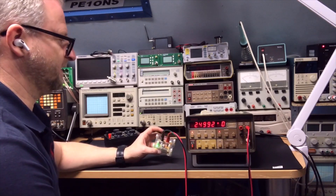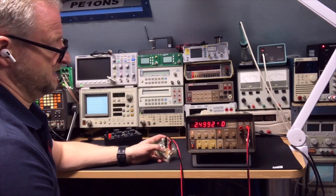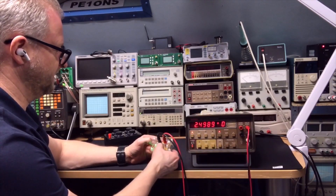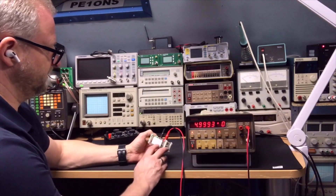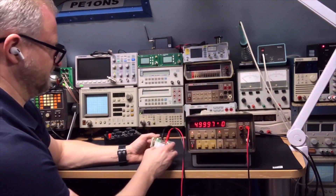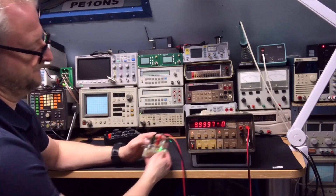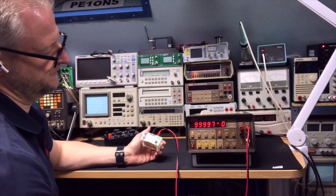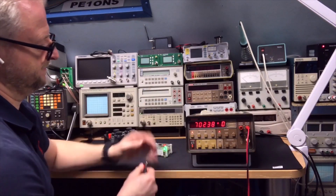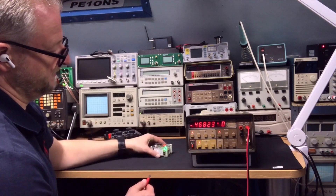We put the voltage reference, it is in auto ranging. Let's put the 2.5 volts — well, that seems to be very stable to me, that is good. It is a little bit off but it also needs to stabilize — we just switched it on. If we have five volts here it should be a little bit above 5.00001, and for 7.5 it should be about that. For 10 it should be 10.00007. Let's see if we put it on zero, if it works like that.